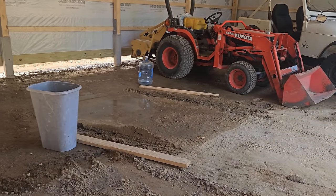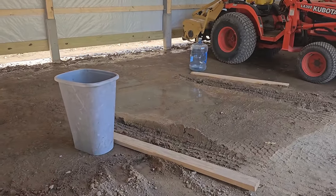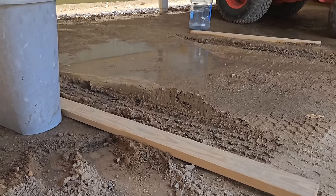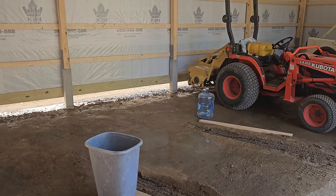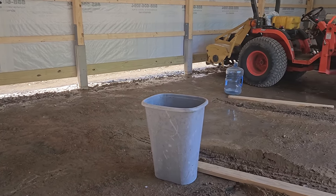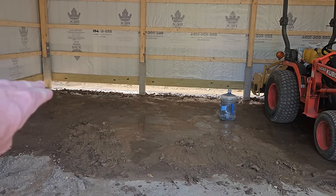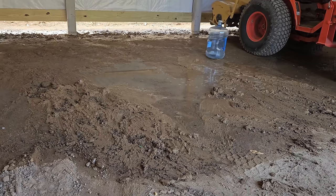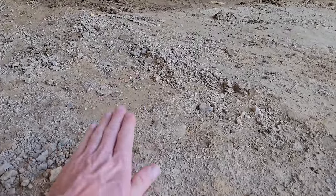I'm putting ant traps out as I pull these up. We had a big rain yesterday and water did exactly what I was worried about - it all pooled in the back corner. Some did come in and when it was raining there was like two inches of water in here. Everybody says put four inches of three-quarter clean stone, but I feel like your subgrade should be higher and compacted before doing that - that way when it rains you don't invite the water in. If I had the drainage done back there I don't think this ever would have happened.